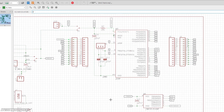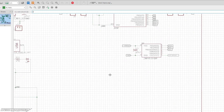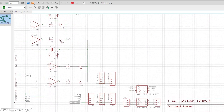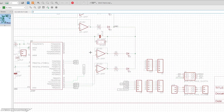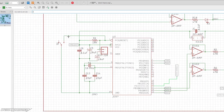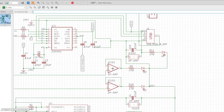This means you can't accidentally upload your code to the master if you forgot to flip the switch from ISP to serial mode. I made the necessary connections from the master part of the circuit to the three potential targets: another ATmega328, an ATtiny, and the breakout headers for the pogo pins. When switching from burning bootloaders to programming targets, this switch simply connects the master reset pin to ground, locking the chip in reset mode — essentially the same as removing the master IC. The serial signals will then move along to the target IC uninterrupted.